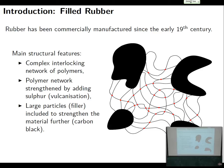So what you had was a tangled mess of spaghetti, which when you stretch, all the spaghetti flops all over the place. When you add the sulfur, the bits of spaghetti stick to each other and suddenly it's got a much more rigid structure. To add even more rigidity for something like a tire, you need to add some larger particles as well — that's the filler. The reason why tires are black is because of this filler material, and the original material people found was very good: just soot, the leftover residue when you burn stuff.